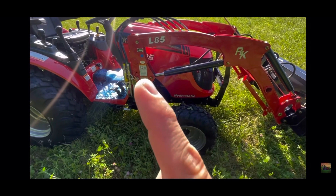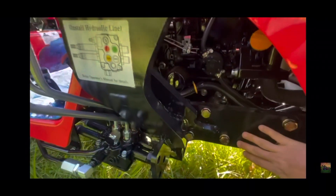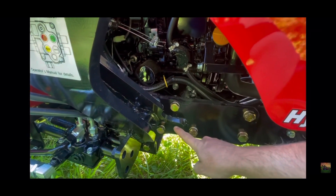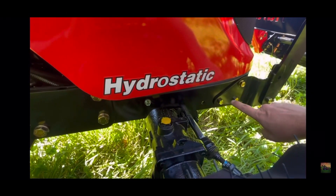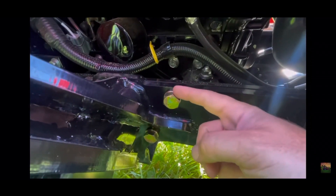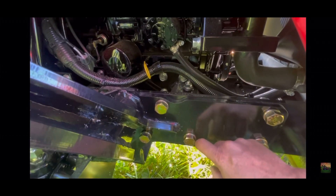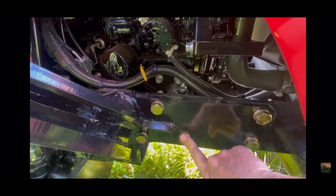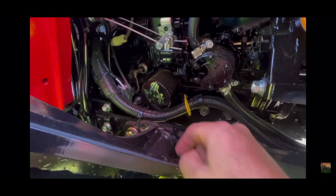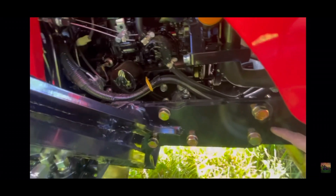The loader arm comes down into a cradle right here onto this piece, which attaches to the actual frame of the tractor. These bolts here — and even on the brush guard in the front — you want to make sure these bolts stay good and tight. You can look at the compressed lock washer, but these bolts, as you use your front loader bucket, they get twisted and turned and put under pressure. You want to make sure even this bolt on the back of the frame stays tight, so you're always checking those.